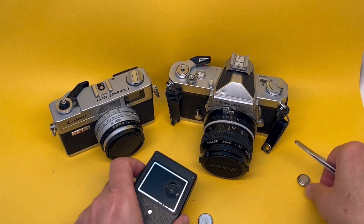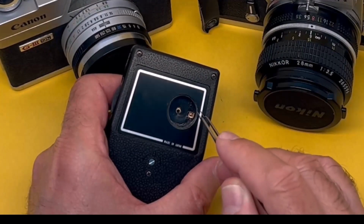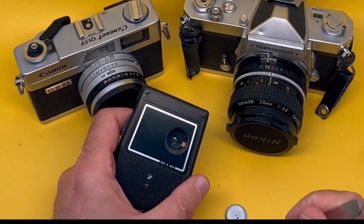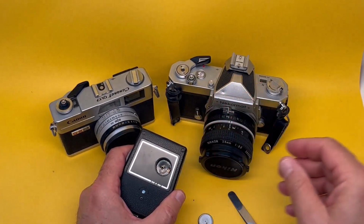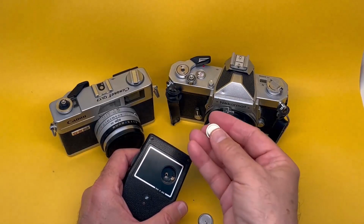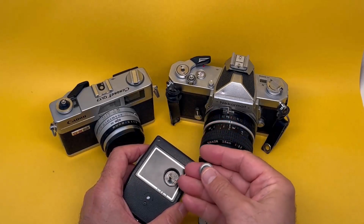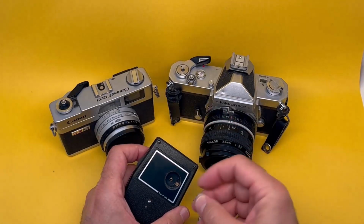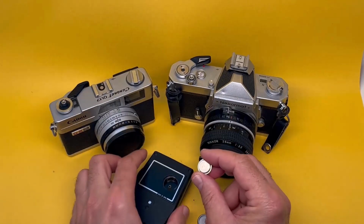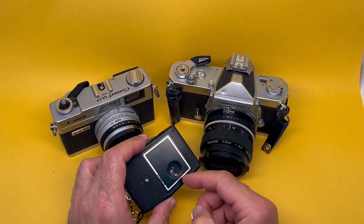So all these chambers have to do is to make a contact with the negative side and some kind of contact with the positive side. And that varies considerably from device to device. Each one of them has invented a new way of doing it. So that's all you have to be conscious of. Anyway, we need something that's this shape, one way or another, with a connection point to your device, the two contacts. Now, if this shape is not right, it's not wide enough, it rattles around and sometimes loses contact with one or the other point.